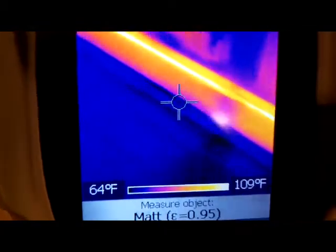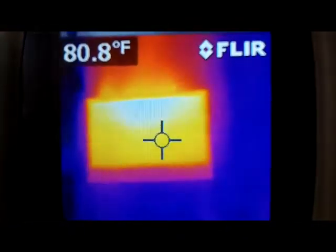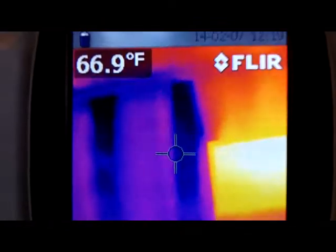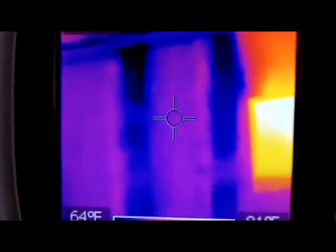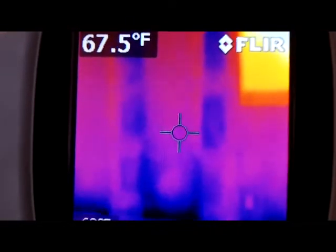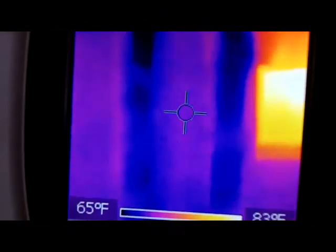Here's my living room wall on the first floor — looks normal, right? The FLIR tells me my TV was turned on because it's hot. That's a plasma TV, it gives off quite a considerable amount of heat — 82 degrees. Notice those two blue lines going down the wall. In the summertime when I turn on my air conditioning the walls were a reddish color, but those dark blue lines are my air conditioning six-inch tubes going downstairs into the basement — that's how my central AC goes from the roof down to the basement.